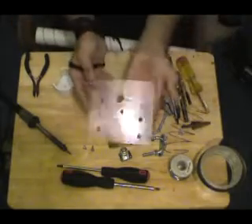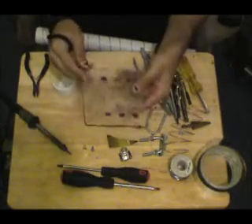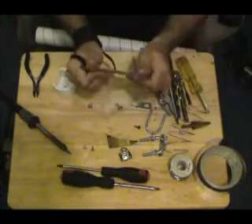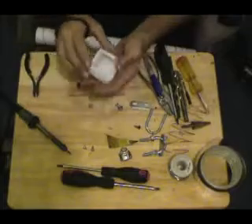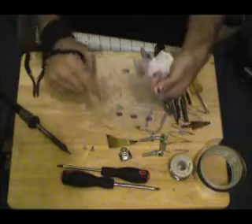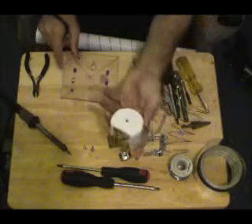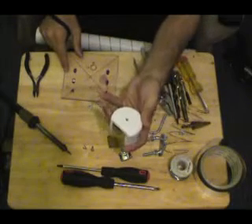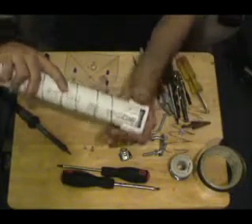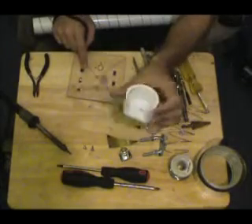To build the reflector, I got a piece of clear plexiglass — it's about one-eighth inch thick. You can use whatever you've got laying around the house, but you need something strong and firm; you don't want something very flimsy. I cut this to the reflector length, 5 inches. I made an X going across it to mark dead center, and I drilled a hole. I also drilled a hole dead center inside of a 2.5-inch end cap, which this pipe will fit into, per Jason's instructions. I've also cut the side off, per Jason's instructions.